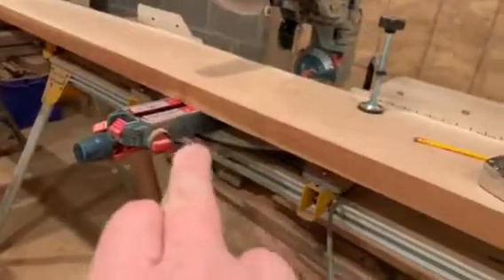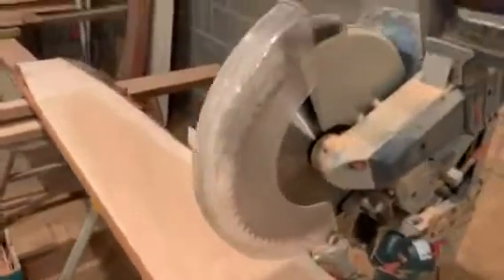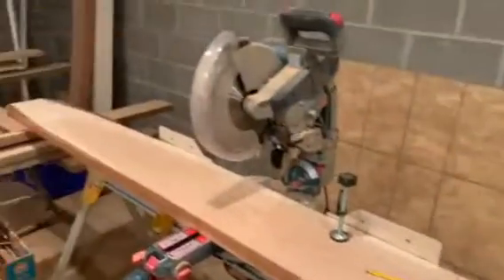The reason is I don't want this board to bind and shift on me. Here's a piece that holds this board down. You see the board sits on the plenum of that and it goes all the way over — there's the end. It's an arm that comes out and I rest the rest of the board on that, then I'll make that straight cut. It sits on this plenum and I have that one only out about three feet, but it's enough to hold it so I don't have to waste energy trying to hold these boards and keep them from binding and shifting.